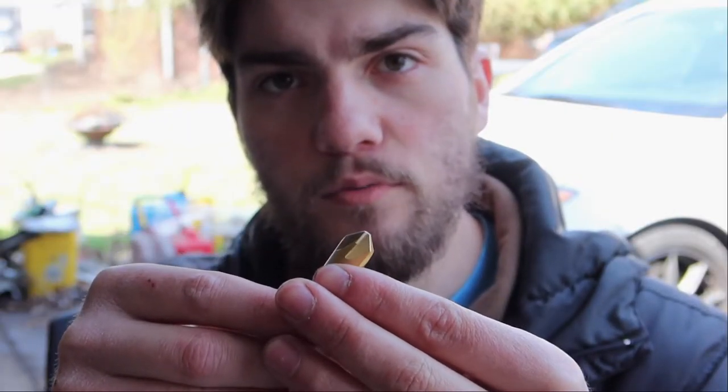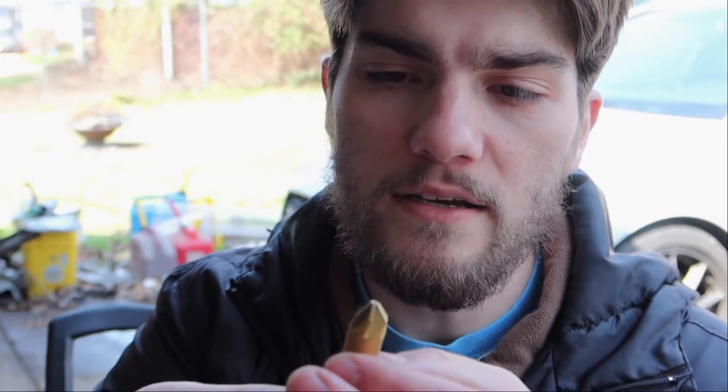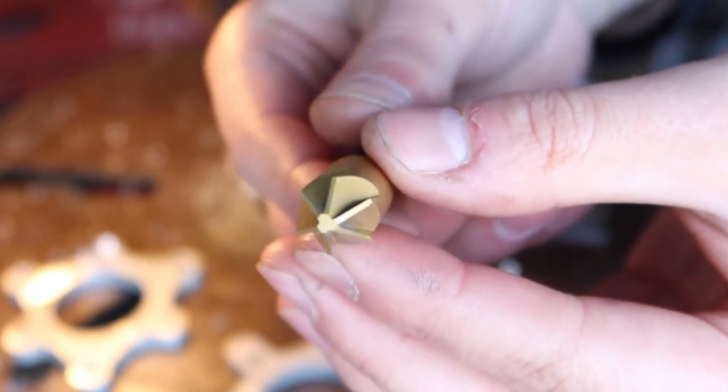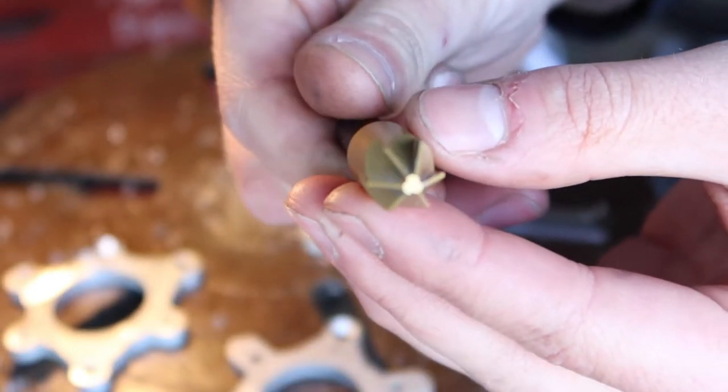Something like this is what I prefer to use. It's got six cutting edges and I buy these from McMaster-Carr. It's a high quality countersinking bit, and it terminates at three points in the middle rather than just six equally spaced cutting edges. These consistently leave a very good shiny finish — they don't chatter, and as long as you don't force it, just let it cut at its own natural rate of cutting, it leaves a very nice finish every single time.